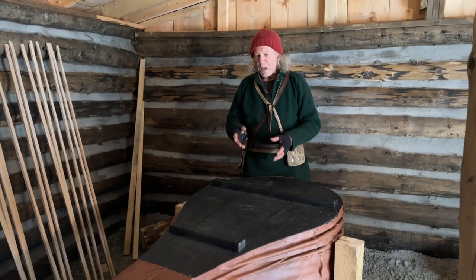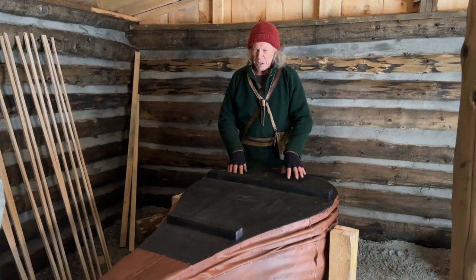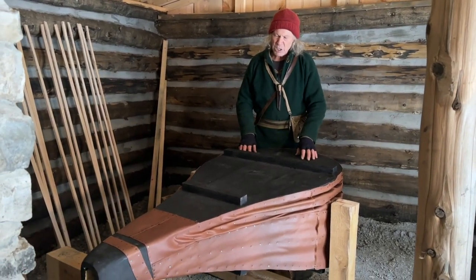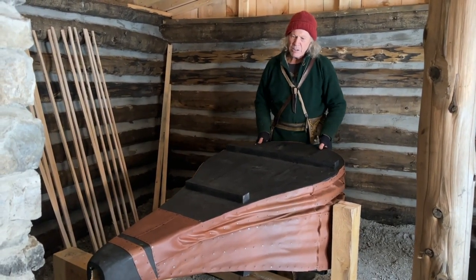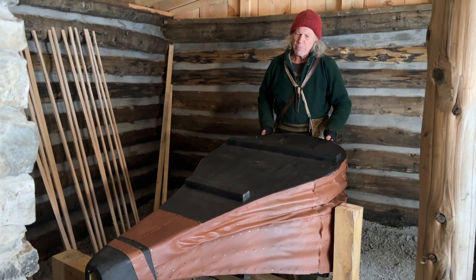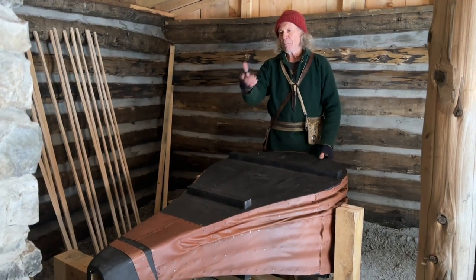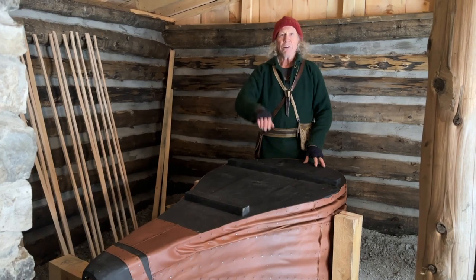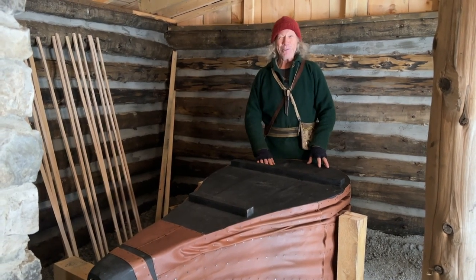And as far as tweaking goes, they call it weighting the bellows. So I've got some bars of lead and I can play with how much I need. So it's the speed that this bottom's going to sink. When the valves open on the bottom, this has to sink at a certain rate to give me the maximum amount of airflow underneath the firebox. Bloody well works.